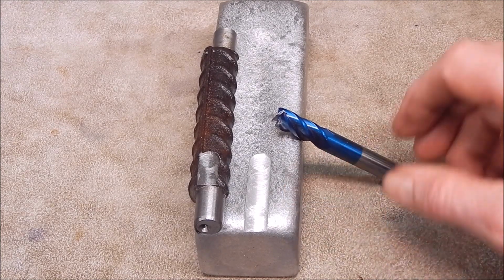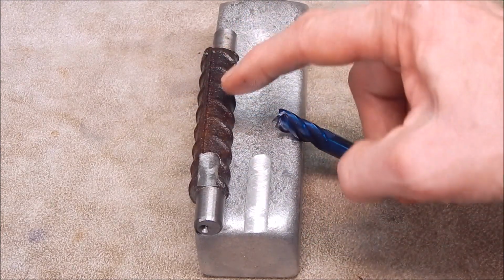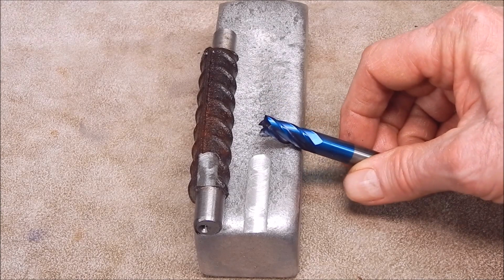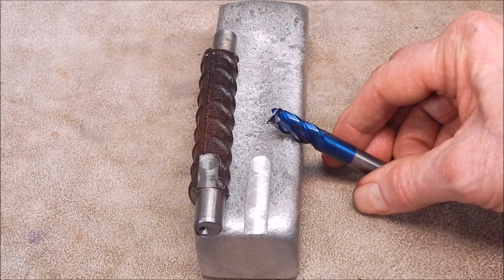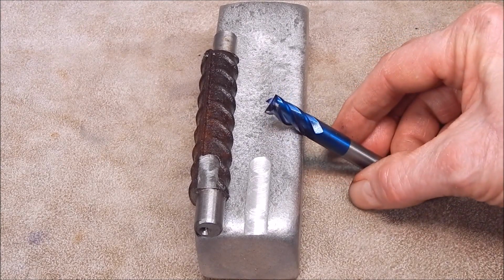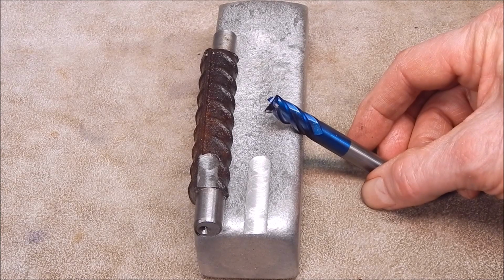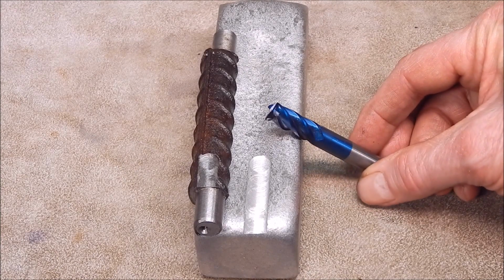Now, we've proven that it'll mill this stuff, which is quite gnarly stuff. It's got a hard outer coating and it gets softer as you get in. The coating didn't crap out or come off. It all looks good. There's no chipping whatsoever. And there was enough heat there to smoke the old Kero engine oil lube mix. So that's where I would normally run those sort of speeds. I wouldn't normally go higher than, say, 800 for high-speed steel.